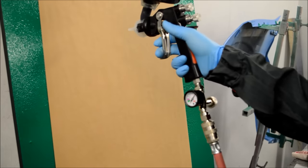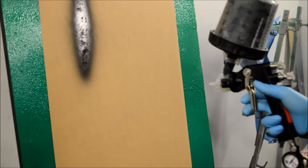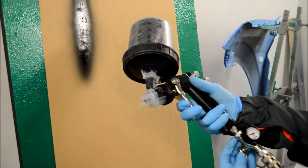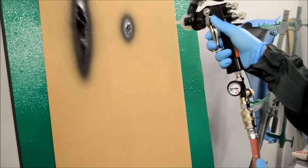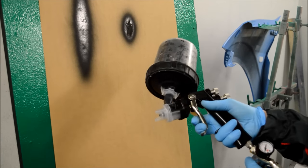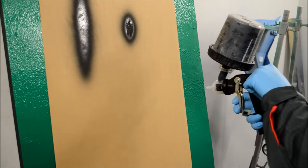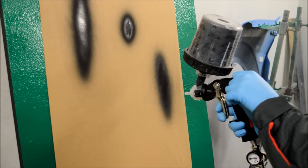I just thought I'd show you the different spray fan patterns that we can get using the gun. The first one is the fan fully wound out, and I'm just going to screw the spray fan adjustment in a little bit to show you how far you can take it down. This is the spot — it doesn't go to a complete circle but it does go to a very small fan. I'm going to start with the big fan and take it down slowly to the small one just to show you how easy it is. It's pretty much like a normal spray gun really at this point.